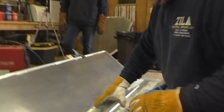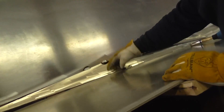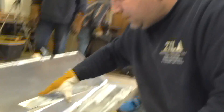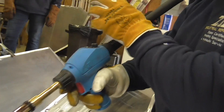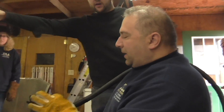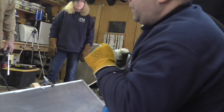This is kind of the same thing as the boat — same material, same thickness. You have a fairly tight gap on the top, not perfectly tight, but you have this huge relief on the back side. Now if you have a pulsed welding machine you can dial it down further. What I did is I installed a push-pull gun, which is similar to a spool gun. It has an extra wire feeder in here, but instead of carrying the tiny roll, it all comes through the cord right out of the machine. The whole idea is this is pulling and that's pushing — really pulling here and feeding, only pushing through 8 inches. So that's to not clog it up — you're not pushing rope uphill. So you can use a soft wire in there.